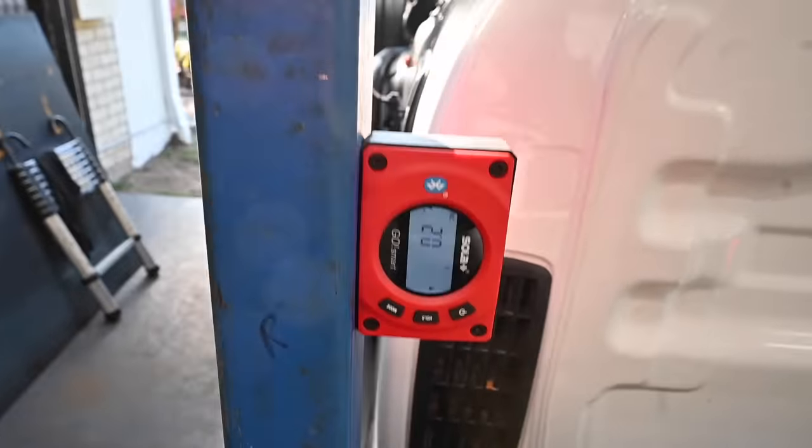I've got my two boxes on at least anyway, space cases, got that all nice and neat. Still got to finish up my wiring, so light bars on top, rock lights underneath it and stuff. I made a bit of a start on my 12 volt, so I got what I'm gonna run my fridge off here, just my positive and earth wires as well as just a manual override, so I can link two batteries and a VSR. It's just tucked in there. Neat enough for now, but I've got to tidy up all that.